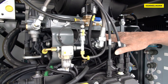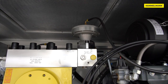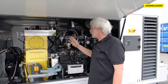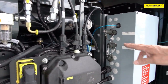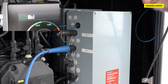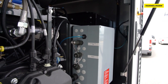Here is the air tank of the built-in compressed air system. The compressed air system is required for the pneumatic bypass control system and is a standard feature. The bypass valve which can be seen here is used to switch the system from pressureless circulation mode to high pressure mode or back again. This is done via an electrical signal that is connected to this socket right here.